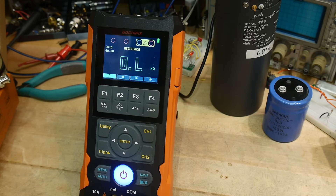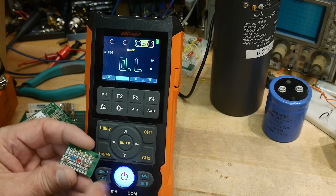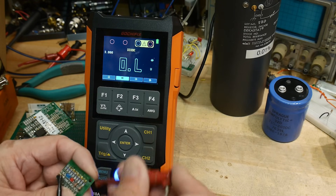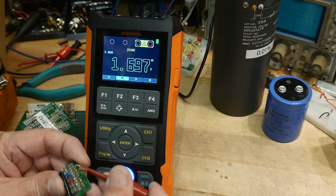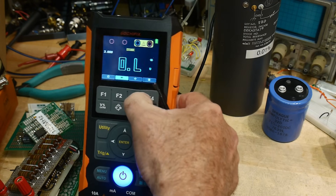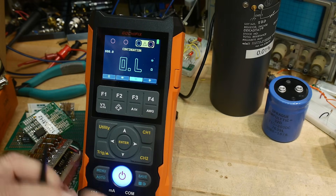You can either like or hate the display. Let's do the diode check. A Schottky reads 0.3. A regular silicon reads 0.64. An LED reads 1.6. And a blue LED reads 2.5. So it will go up to three volts for diode checking, which is nice. Continuity check — it's latched, and it's pretty fast.